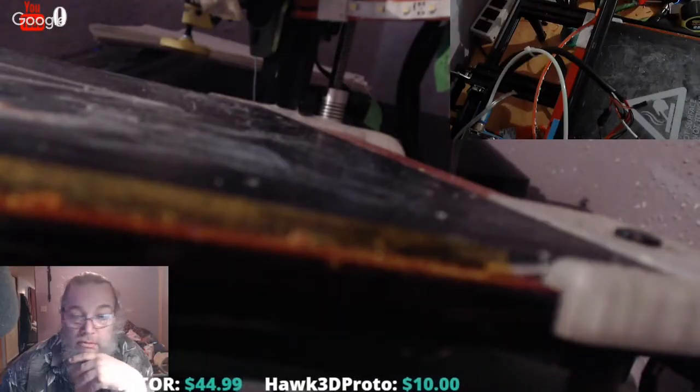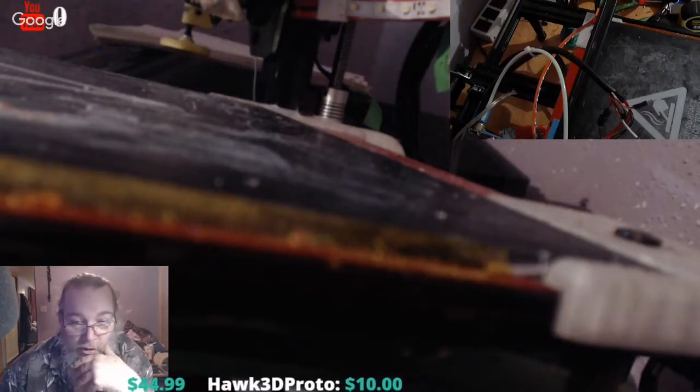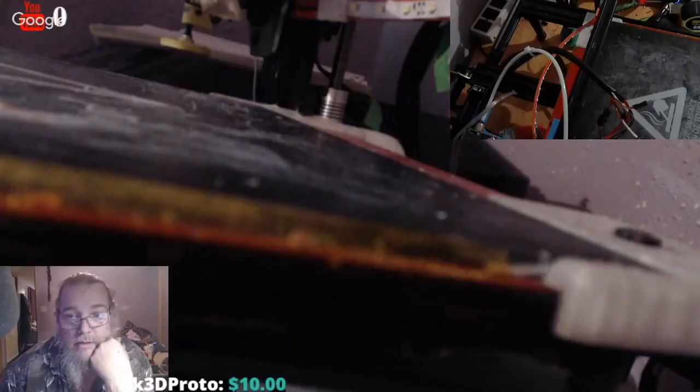I've got to get my settings a little bit better on my retraction here, but otherwise it ain't bad. Well, I noticed with Idea Maker, I can generally half to a third my retractions over Cura or S3D. Actually, I don't know why. I set the speeds the same, my travel's the same, everything's the same, and yet I'm still having stringing, and I gotta up mine. I've gotten blobs because I set it too high, and it retracts and then overextends, and I get a blob with Idea Maker.